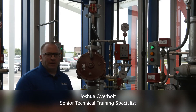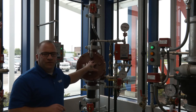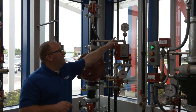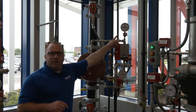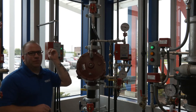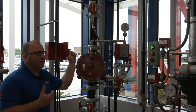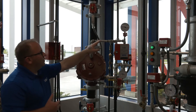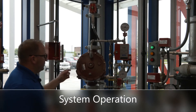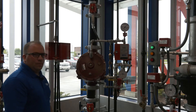Hydraulic release valves are sometimes referred to as a wet pilot. In order to operate this valve, we simply have to relieve the water pressure that's holding the valve in the closed position. That water pressure can be relieved through the manual release located here in the riser trim piping, or through the hydraulic release piping or pilot piping out in the protected area. Operating this valve would cause us to lose our prime water pressure, which would cause the valve to trip.